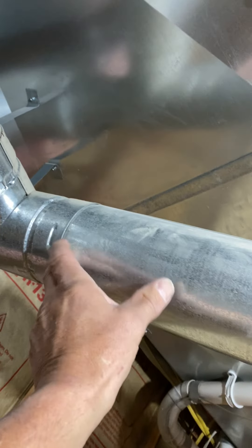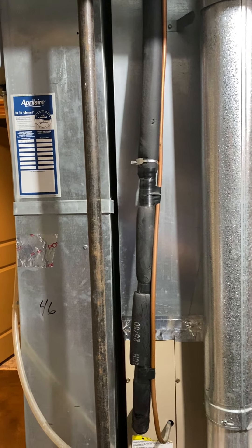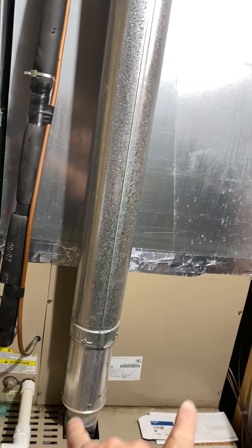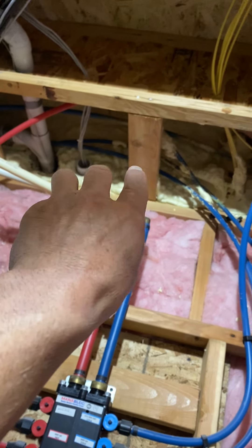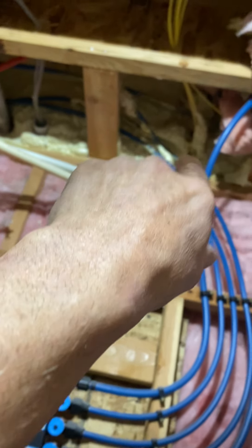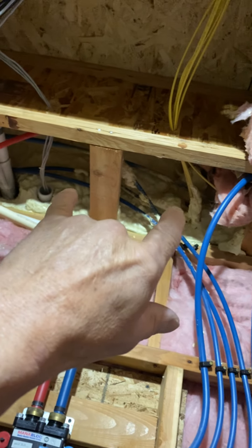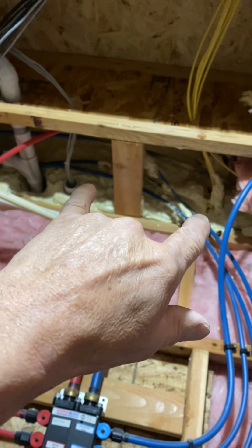Combustion air is okay, it's right there. Label it. For the vent, we're going to take this vent off and put a four-inch aluminum cap in there. For the flue vent, three-inch PVC going up, following over somewhat by this radon pipe. You may need to remove a two-by-four. There's a bunch of wires in there and also a house spigot, so make sure you know what's back there.